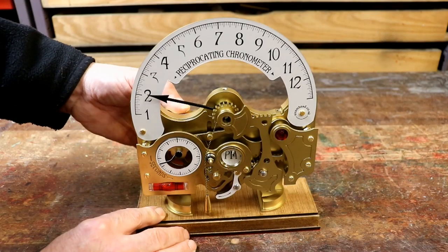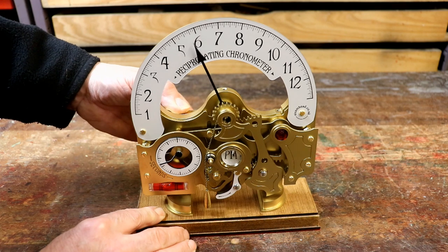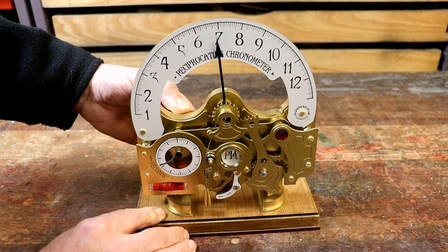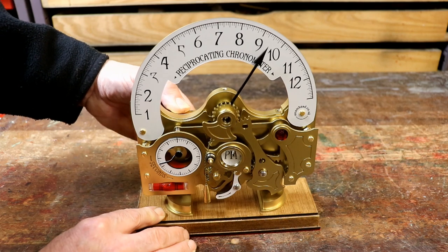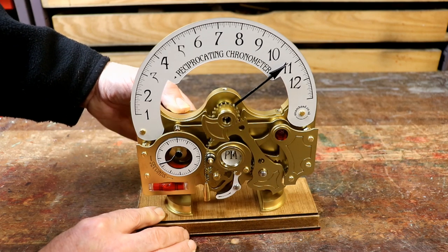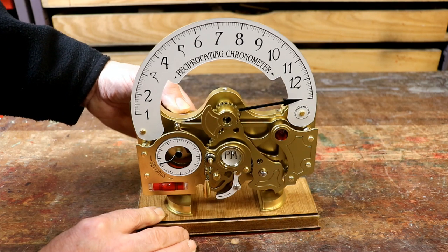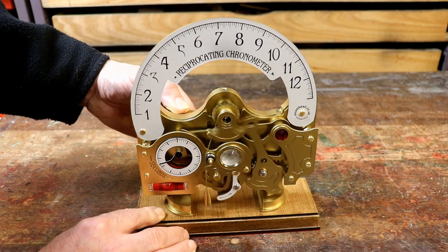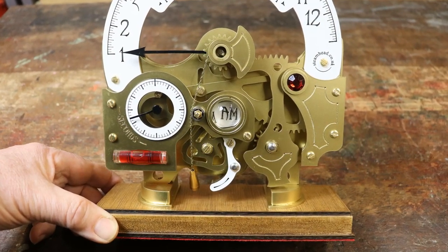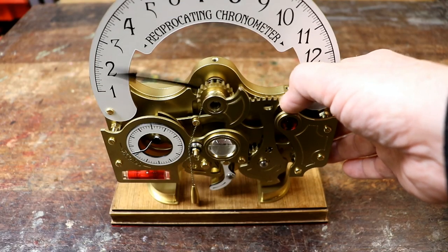To check if the clock mechanism works, turn the time adjuster on the back of the clock movement in an anti-clockwise, counter-clockwise direction to check whether the hour hand moves slowly over to the right until it points to the furthest time readings on the right of the hour display. It should then move back to the left and point to 1, and the AM-PM indicator should change. If it doesn't, or gets stuck, check each part of the mechanism moves freely.